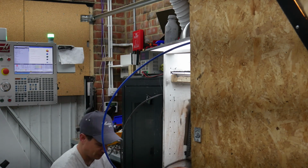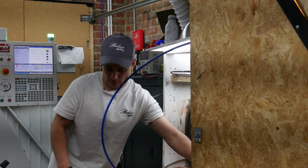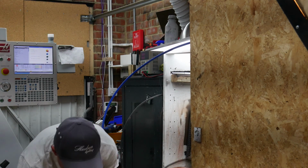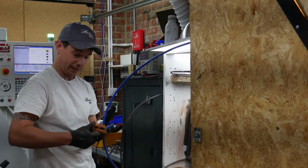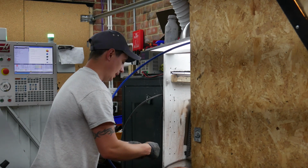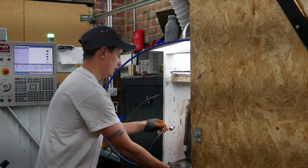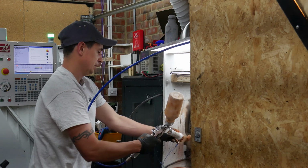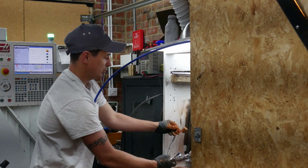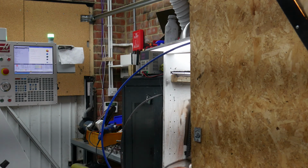But I really want to anodise black because it adds a finish to it, because the black against the CorTen or black powder coat or green powder coat looks a lot better than the silver. So there is that element to it, and if the powder coat gets chipped, it also doesn't show as much when it's been anodised. So we will get it resolved. I think what's likely is that we're going to move the anodise in with the powder coating.